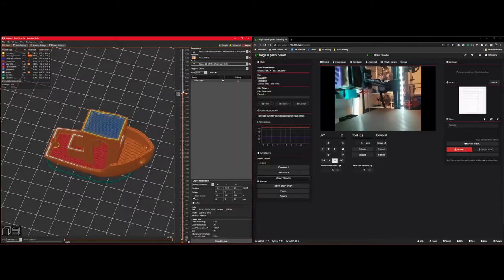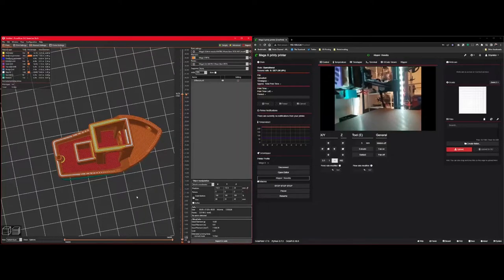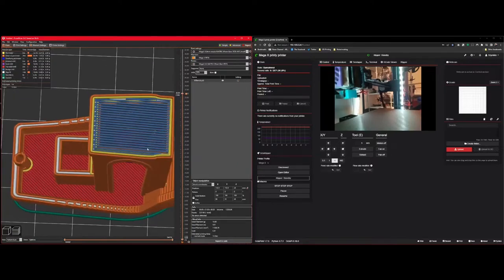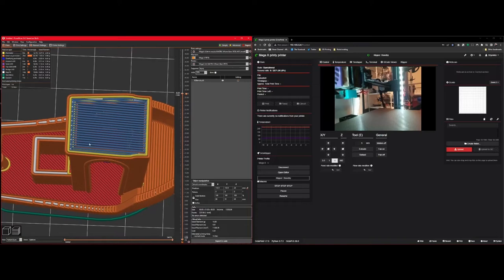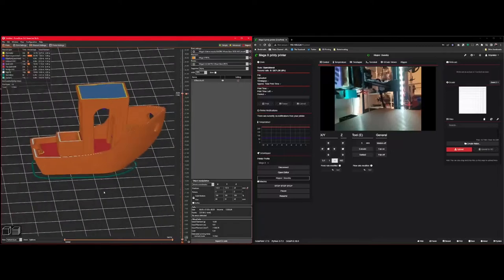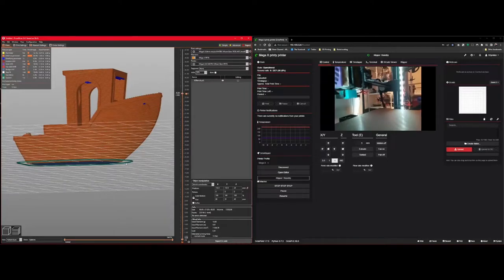So if you see this layer is basically a rectangle, and it's got no top, but you can tweak your settings and set a bunch of things so that it can go through and bridge, and you shouldn't get too many droopy strands of plastic if your bridging settings are right. So what you've got to watch out for when you're CADing your own objects or printing things is that you can't expect it to print over air unless it's got something to attach to on all the different sides. That's about as steep an incline as you can get on that bow there.